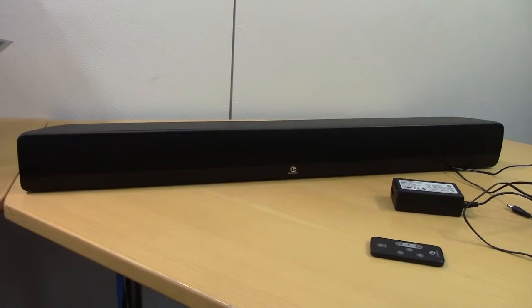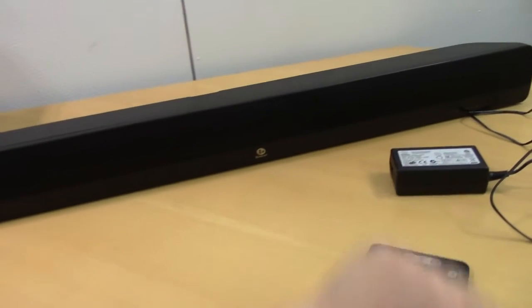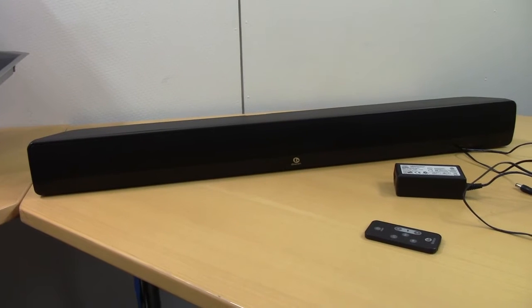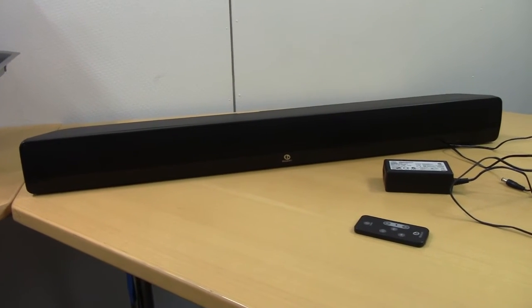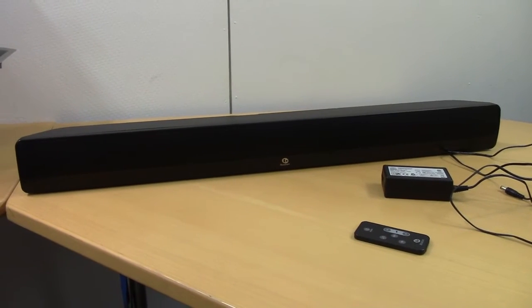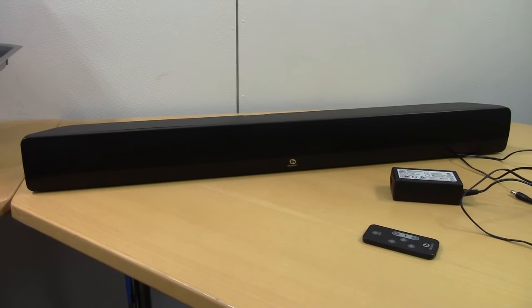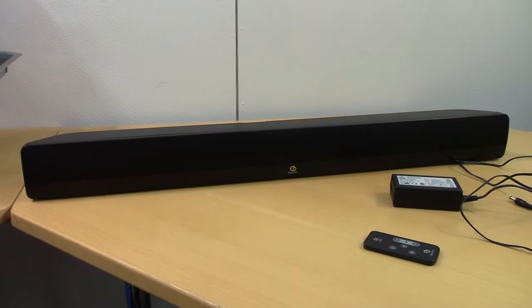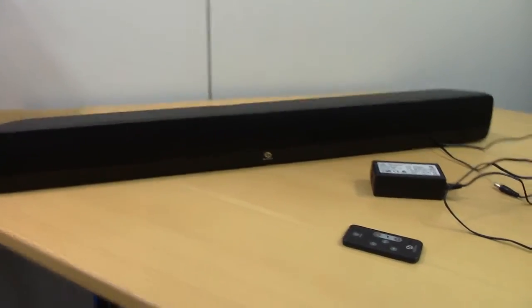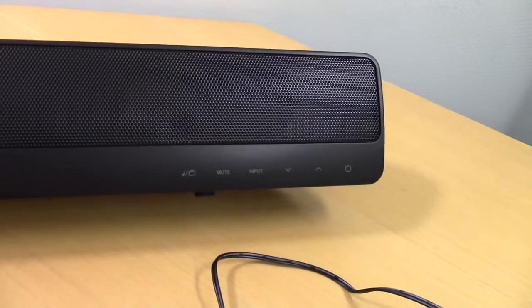When I first paired it up, it was kind of working. This little power supply guy was making a horrid screeching noise and the thing wouldn't start properly, but when I replaced the power supply, it would actually power on, and it actually sounded fairly good. However, even with the other power supply, it has a bit of an issue where it keeps resetting and imagining input that doesn't exist on these capacitive touch buttons.